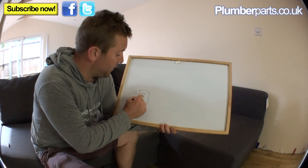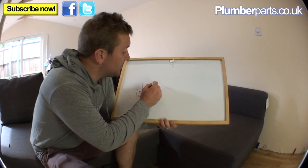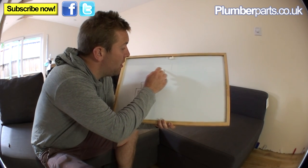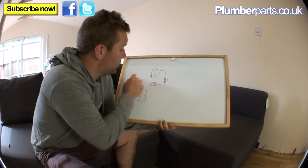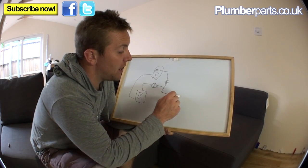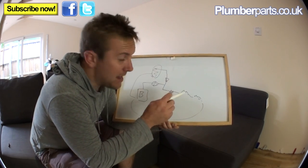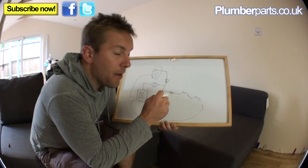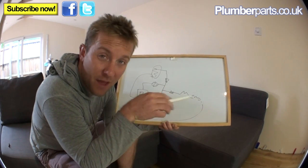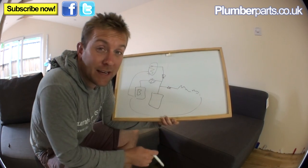These systems have the usual boiler with a pump. Basically, you've got to see them as a zone in the heating system. So let's say we've got our pump with a two-port valve going up to our coil in our hot water tank with a return going back to the boiler. Then we have a zone valve for the radiators upstairs in a house going back to the boiler. And then we have another zone that has its own valve and its own small jockey pump, which will make water go around the underfloor heating system.